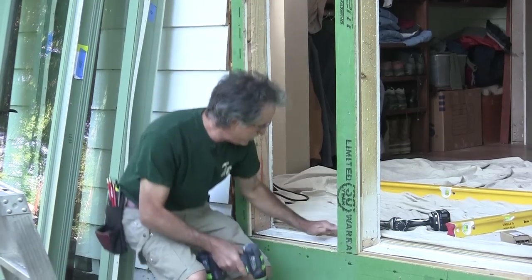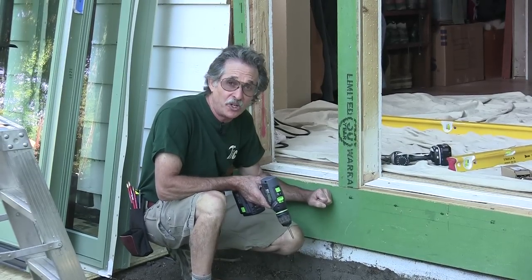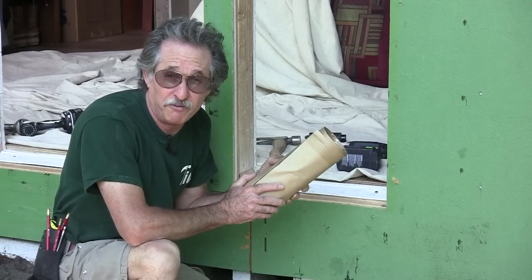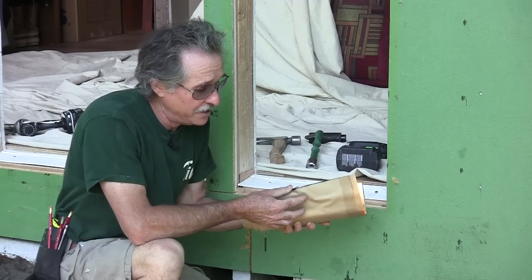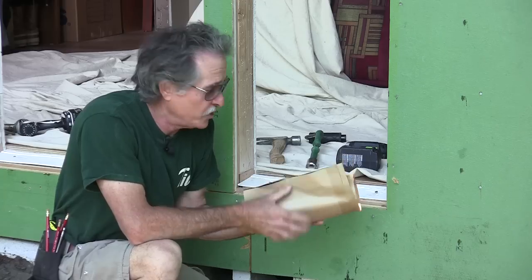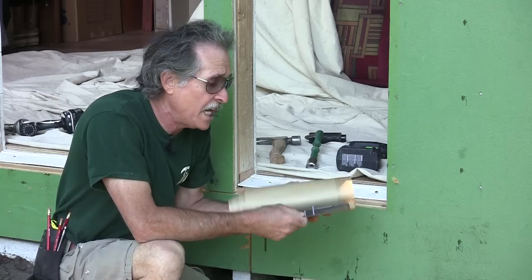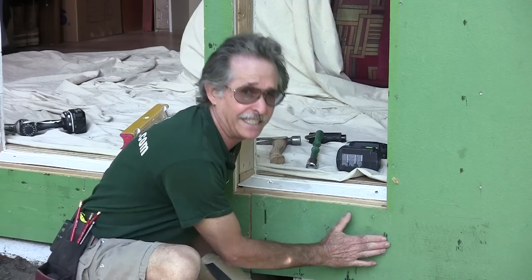Now we've got the cant strips in. The next step is to put in the sill pans, but really I can't put the sill pan in until I attach the ledger to the wall, because the sill pan is going to come down over the sill and wrap over the wall and cover the ledger too. This is a peel and stick waterproof membrane, and it can be a major pain in the neck — once you pull the release paper off the back, if this stuff sticks to itself you may as well throw it away. But because it has such good adhesion it'll stick to the zip wall really well. We're also using this because it's self-healing: if you put a nail through it, the membrane will heal around the nail, making it a really good waterproof membrane behind the ledger.